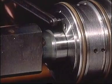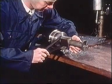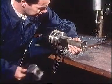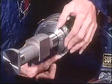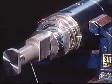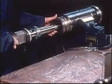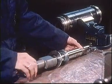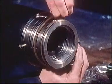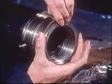Loosen the circular nut with the aid of the face spanner and a copper hammer, and screw it out from the barrel. Then carefully pull the plunger out and put it down on the bench. Remove the 2 rubber rings from the barrel, clean the barrel with kerosene and blow it dry with compressed air.